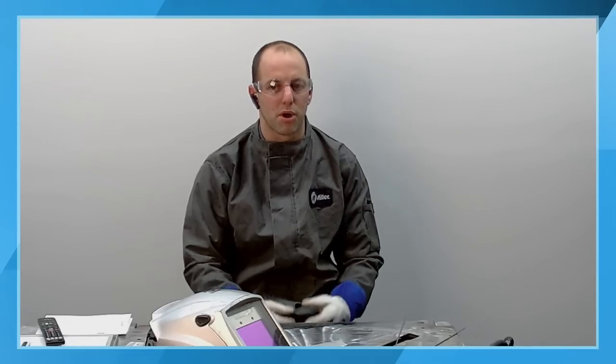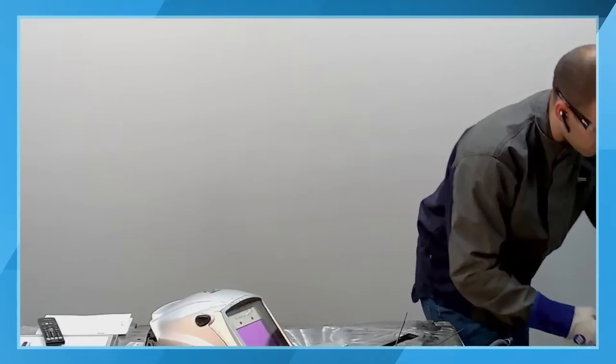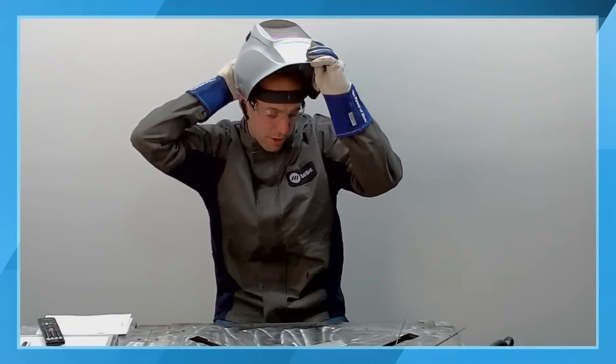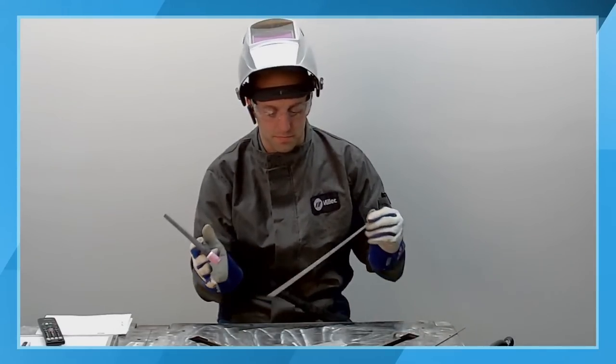One of the things that I've heard from people over the years of dealing with different people in the industry is about pulsing: they don't like that buzzing noise. So it's welding on steel, stainless steel, they don't like to have that buzzing noise associated with that. In the Dynasty 210 and 300, we have a new functionality called pulse wave shaping that essentially lets you select either sinusoidal or triangular waveform that takes the noise out of the pulsing. So I'm going to go ahead and switch that over, and I'm going to turn it to a sine waveform. And the pulsing still is on, but you're going to notice that there's no noise associated with it.